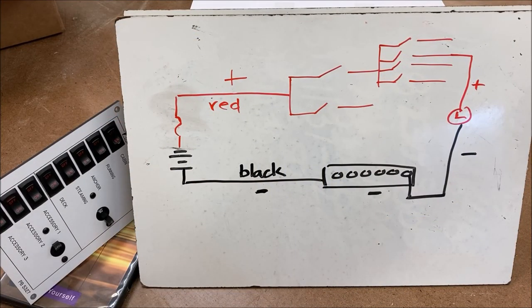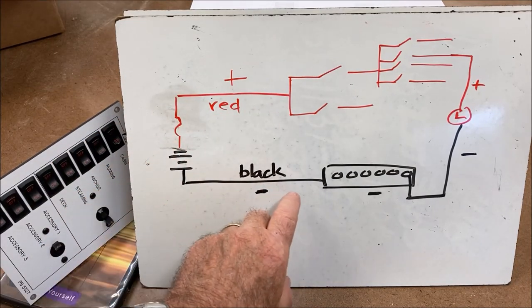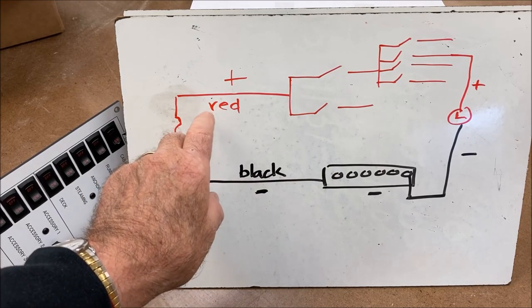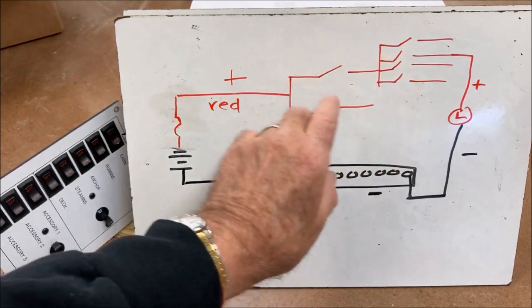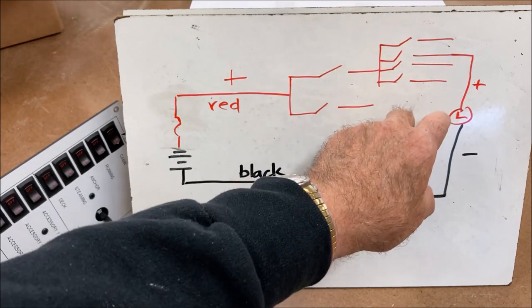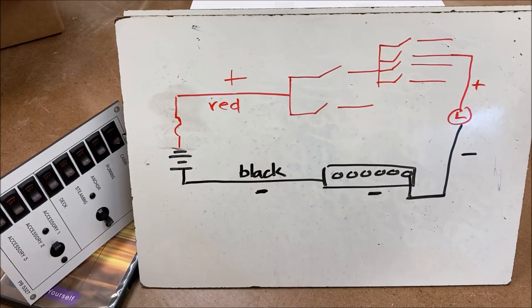Let's look at what we're trying to accomplish. We have the big battery, a 30-amp fuse, and all the red wires come from the positive side. All the black wires connect to the negative side via the bus bar. On the positive side, the red wire goes to those two big master switches, powering the regular and auxiliary sections, and all those switches are also circuit breakers. Our goal is to cut the existing wires, label them, and reconnect them to the correct switches on the new panel.